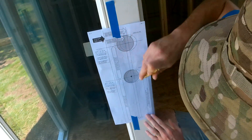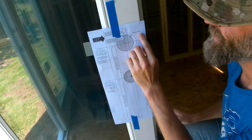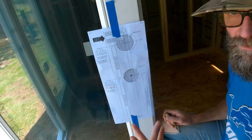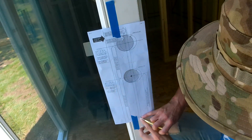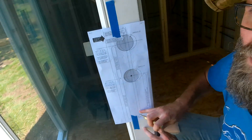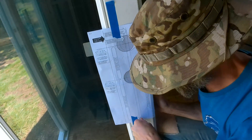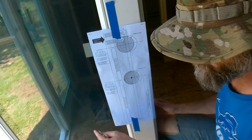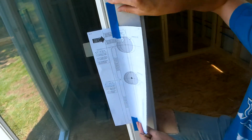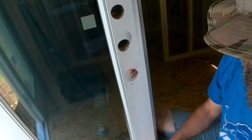You've got to be careful because there are two sets of layouts — one for 2-1/8-inch backset and one for 2-3/8-inch. Here we're 2-3/8-inch. So we've also got two pilot hole marks; make sure you mark the right pilot hole. I'm going to use a brass punch. You can use a hammer and a punch — be really careful if you have glass here. I think we're good to go. Get a 3/8-inch drill bit and we'll drill it out.